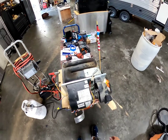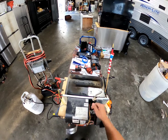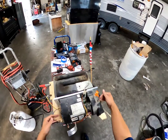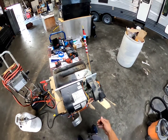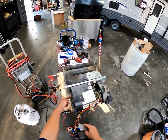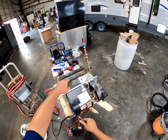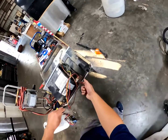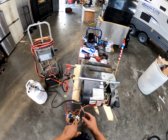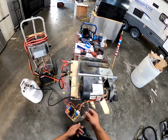We have cleaned our orifice and reinstalled our gas valve. Don't forget to keep this sealed — put some putty there. You want to seal off your propane and combustion carbon monoxide from the inside of the coach. Heat is blowing inside of the coach, but we want our exhaust gases to be coming outside of the coach. We are ready to start it up. That is going to send our signal from the thermostat to our spade connector, from our spade connector to the blue wire on our four-pin harness, and to our limit switch in the back. Through the limit switch, up to our sail switch — with the fan blowing, the sail switch should be closed, allowing voltage through, back to our red wire on our board. After approximately 30 seconds, our board should activate the gas valve by sending positive DC voltage on the brown wire, and we should begin our ignition process with our igniter.